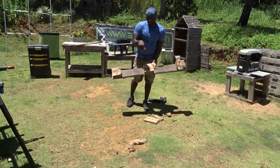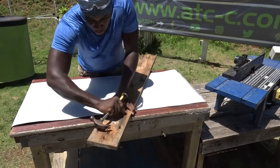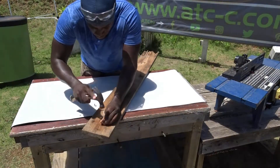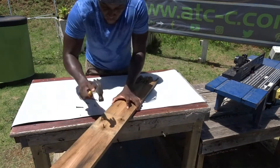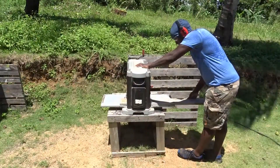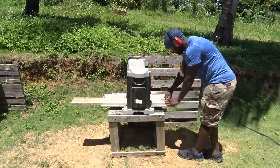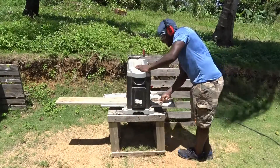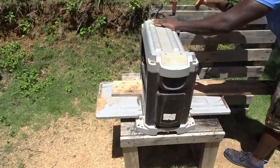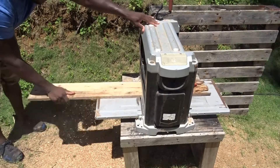Then, using the other part that I'm showing you just right here for another project. And to prepare the wood to be used in the thickness planer, I'm going to be removing the different nails that we have inside, to move just after that to the thickness planer. And remember that if you are doing the same thing, the goal here is to remove just a thin layer — not too much — in order to clean the wood as much as possible, and of course on both sides.